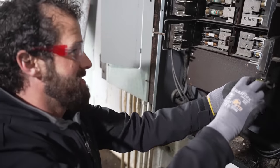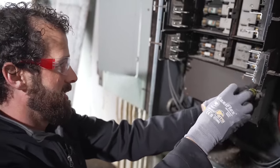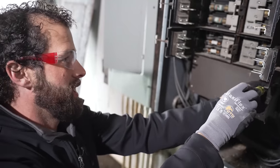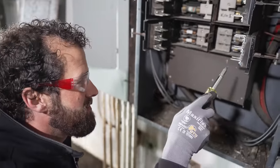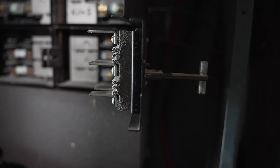So as much as I like Span panels, I do have a tremendous appreciation for what I'm looking at here. It's in great condition. It was really well made. I haven't found anything yet that's broken down. I'll be looking at the connections. Each of these individual connections could be an issue, some of these insulating blocks could have cracked or snapped, or you just don't know what you're gonna find. Could have been harsh treatment of some kind at one time or another.